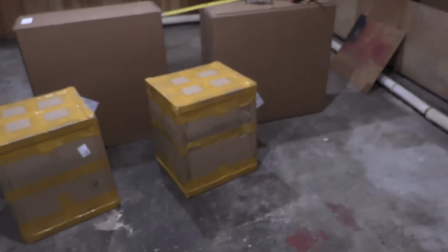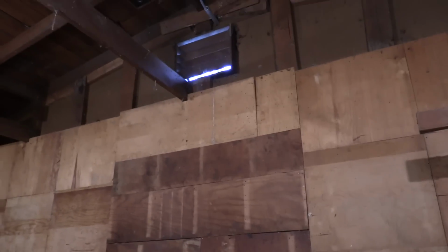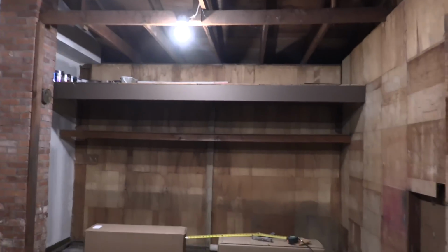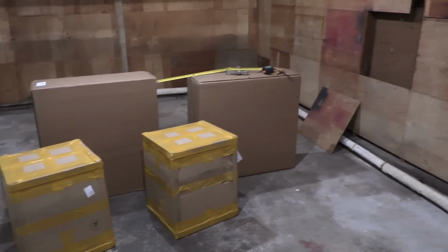So that's really cool. I'm stoked to be EPA compliant. I'm actually happy about that. We're doing the right thing by the environment, and it's the right stuff. So these fans will be filtered on the way in, the air will be filtered in, and then obviously they will be filtered on the way out. I did the math. They say that you need to do something like width times height times length times 10 to figure out your CFM. For a place this size, we need roughly 12 to 14,000 CFM. So if we install all these fans, we'll be absolutely perfect.